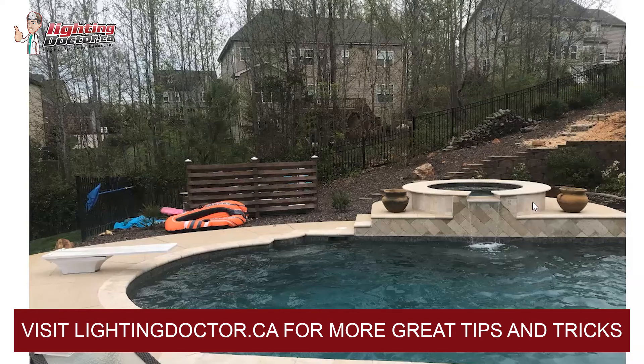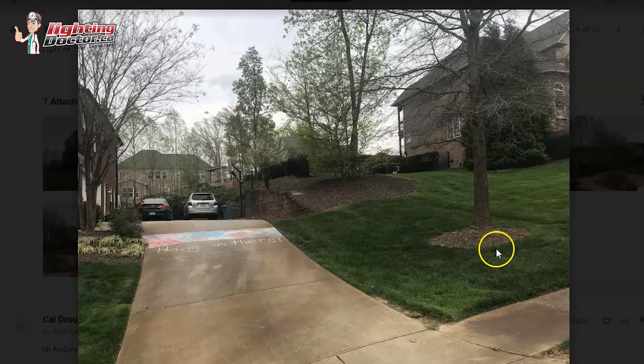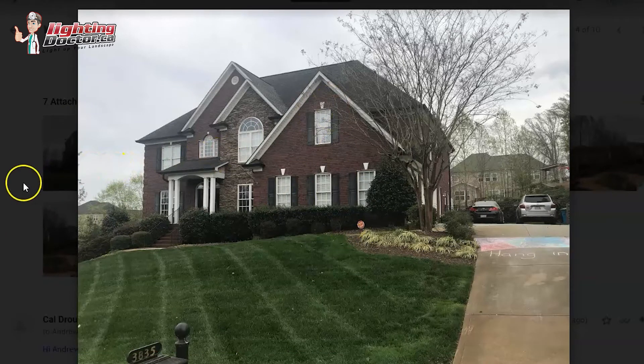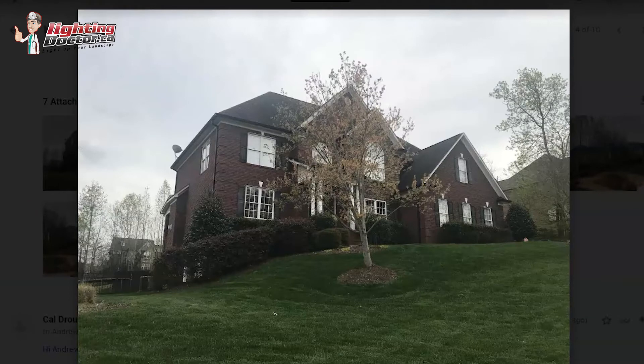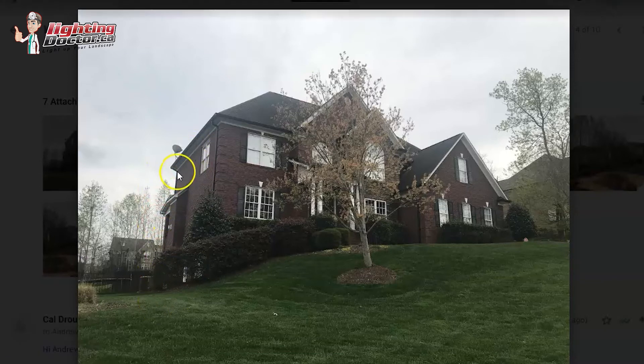In summary, you've got a great property. Focus on the perimeter with the bigger trees as those give you the most bang for your buck. Any unique features, try to get some lights on them; if they're under six feet use a wash light, same thing with shrubs. Taller trees go with the 35-watt equivalent, highlight some trees with more than one light, and do a good job on the front of the house with accent lights and wash lights for lower-level lighting.